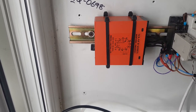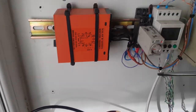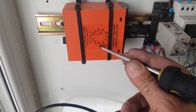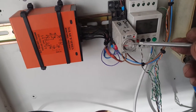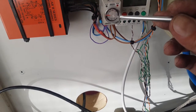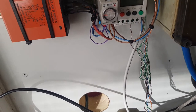So what do we do with all that extra energy? We understand it's throttling — the batteries can't take it, the batteries might be full — we just want to reduce the load. The signal goes through here, triggers it to say there is over-frequency, which means it's throttling down, then passes through to here, which is a delay-on timer. It will then wait — in this case ten minutes, five minutes, whatever you want to program it to.